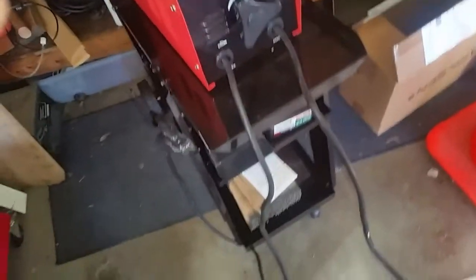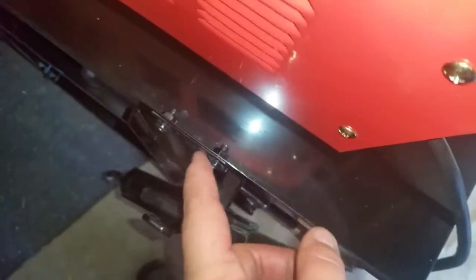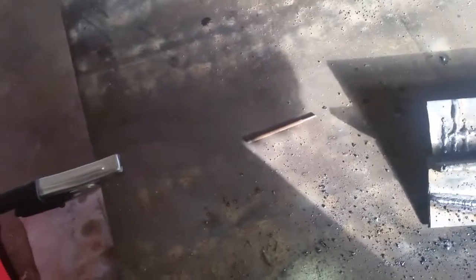You can see my awesome welding cart of awesomeness. I'll put that together eventually — if it's all bolted together, what I would do is bolt it together and then do a bolt-by-bolt grind off the paint and fully weld it, do some stitch welding. I got a wire feed welder, so I could use the Harbor Freight 90. I'll do some stitch welding on this later when I have time and feel motivated. I burned through three full rods and this is a half rod. Something happened — it just wasn't striking an arc at all anymore, it was difficult to get going, so I just trashed it. Until next time, YouTube!